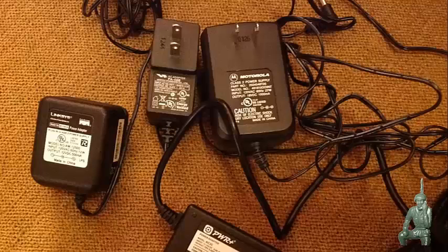So that gives you an idea how to read these power transformer cubes to get an idea of what the input voltages are and the output voltages. For emergency planning, if something were to happen — if you were missing that device or it was broken — you could find out what voltages that transformer was putting out. Using your creativity, a power supply, a solar setup, or batteries, you could match batteries up and replicate that voltage needed for that specific device. I hope I didn't cause any confusion, and as always, thank you for watching my videos and subscribing to my channel. This has been the Comms Prepper video about wall transformers.